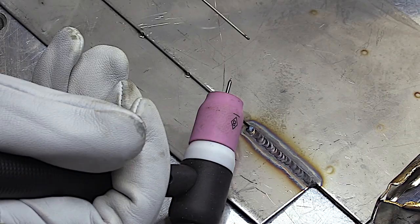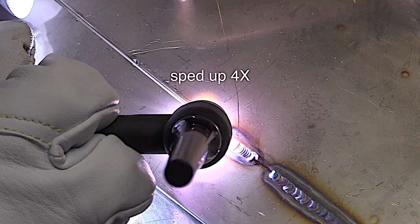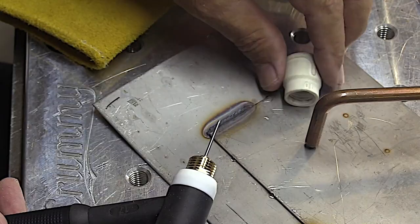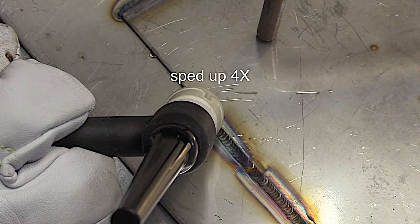Not very good for stainless steel. Now, here I'm using the same exact stick out with the same flow rate with a stubby gas lens — and it's like somebody flipped a switch. All of a sudden it's cleaned up. Now, if I put the Jazzy 10 on there with that secondary diffuser, I'm going to get a little bit better shielding. Not like night and day here, but it's even better. And if I went up to a number 12, it would improve a little bit more.